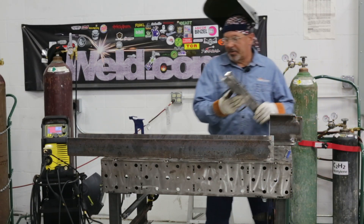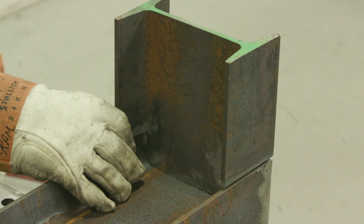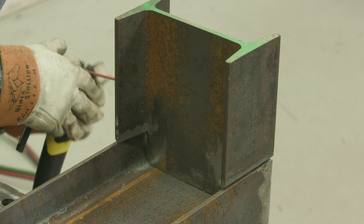Go clean this rascal up. I want to tack these corners up and square it this way. I've got a little mismatch in the flange, but it's not bad. First thing I want to do is get tacks out here on the corner so I can still manipulate it.